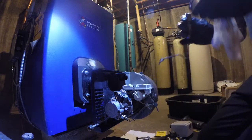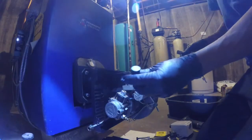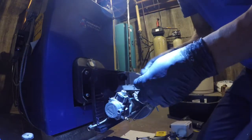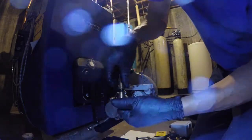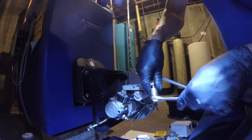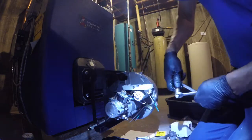Let's look good over here. Make sure the stuff comes out. And it's a nozzle there: 110-60W. This particular unit, they put this on all W. So I'm going to go with the same thing. It's running fine, so I'll leave it alone. This unit seems to be running fine. I believe this unit called for 80, but somebody already set it up for 60. So that's the way it's going to stay.